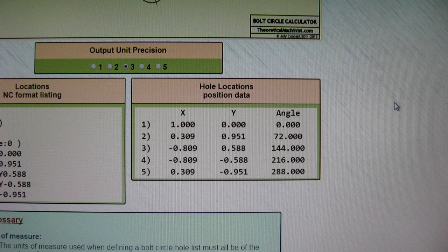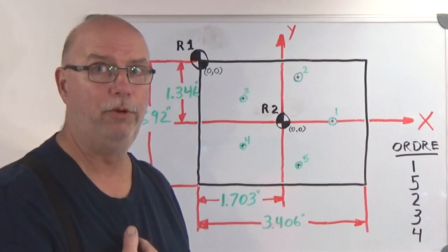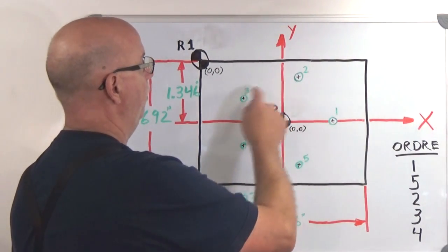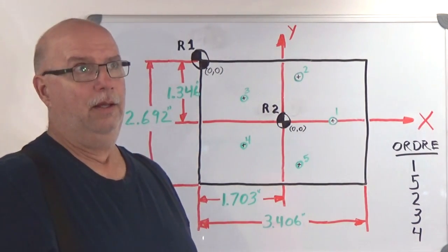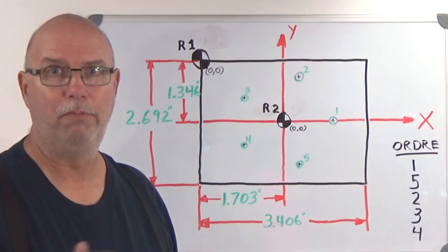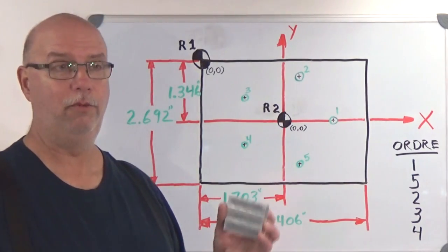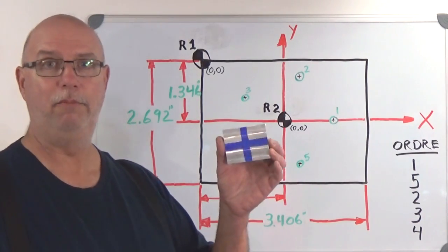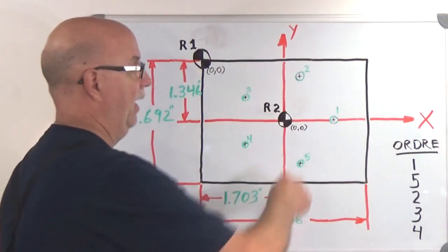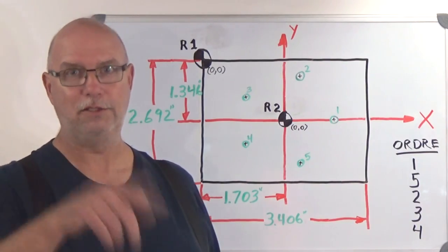Because I have an uneven number of holes, I'm going to change the order I produce them. The coordinates are given as 1, 2, 3, 4, 5, but the order I'm going to produce them is 1, 5, 2, 3, 4. I'm doing that to help with the backlash problems that occur with your lead screws. The first thing to help get around those problems is to go to the bench and lay out two lines — the main axis lines — on the part, which already has layout blue on it. Those lines will help me avoid getting confused when dealing with backlash.